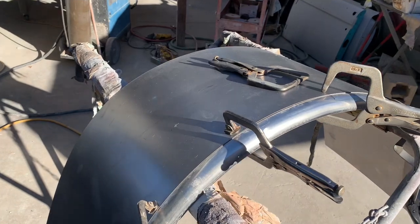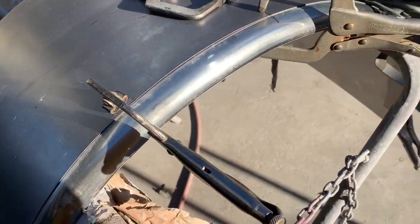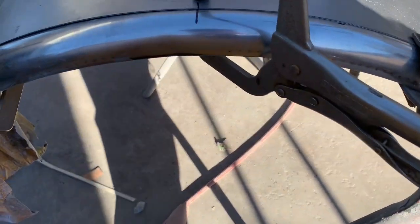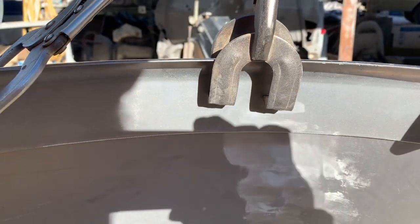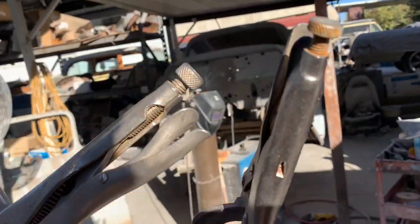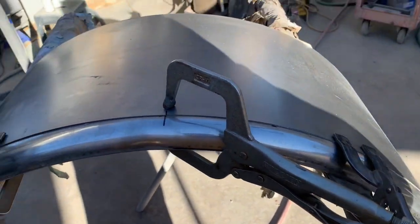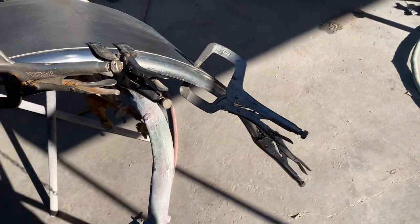So there's the 16 inch piece I cut down at the metal shop because it's a bigger piece than my shear would handle. And let's stand this up. You see, right, the piece off of the tub, I cut it at 3 inches, and then I measured back 2 so that we get the weld right here on this rolled edge here. And when I grind it off, you can barely see it. So it's clamped around with the C-clamps. I'm getting ready to weld it on right now.